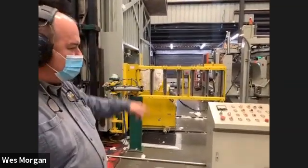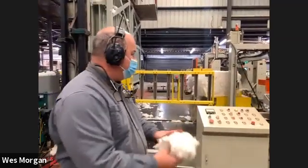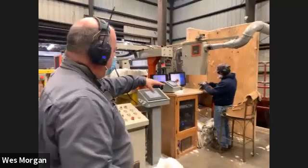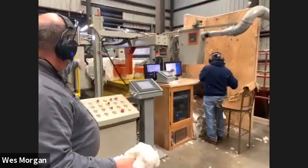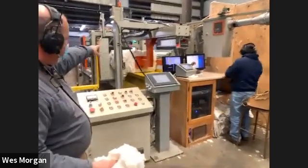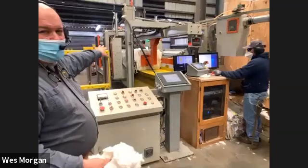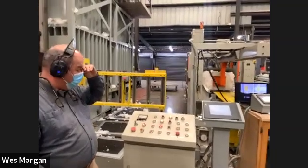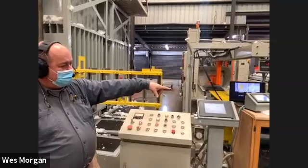All right, the cart sees the bale, and it backs up. So all that's completely automated. If you can see Anastasio here, he's not mashing any buttons or doing anything. He's just watching what's happening. He goes in and grabs a sample off of each side, and it's going to push that bale into a bagger. We're going to put a clear folding bag around it, and it actually forms the bag as it goes to the machine. The samples will get dropped onto his table over here.